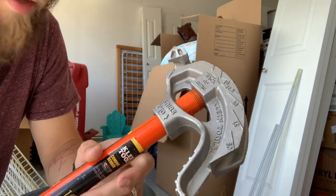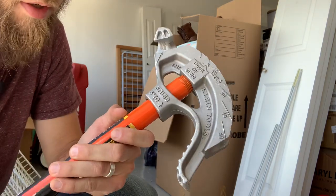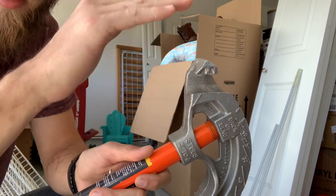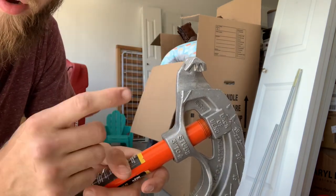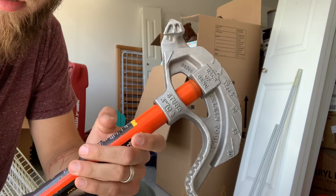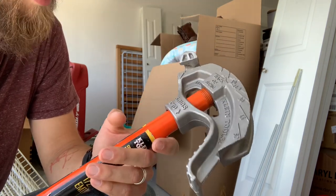And then we'll measure 7 inches. You'll see right here it stubs to 5 inches. That means if you bend at the very end of the conduit, you're gonna have 5 inches from the wall to the very end of the conduit. So that's good. We'll just add 2 inches away from the very end of the conduit and bend it from there. And that'll give us 7 inches, which is perfect. That should be to the very edge of the wall into the box connector.